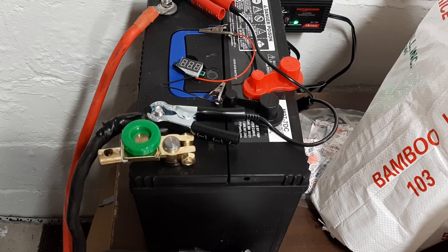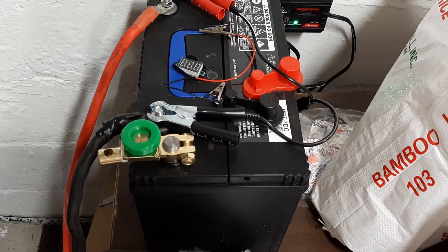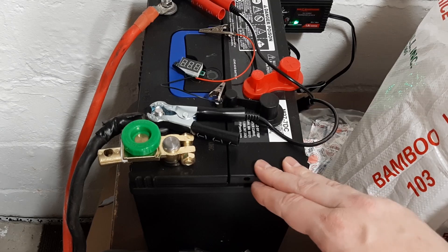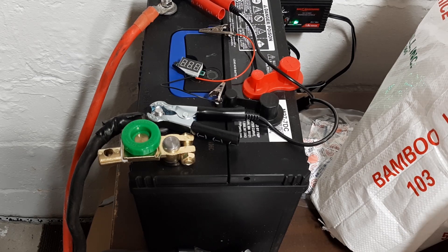If you have a source charging the battery that's running the inverter at more than 19.8 watts, you're good. But this inverter is not 100% efficient - not even close. My guess is probably 10 to 30% loss to noise, fans, step-up voltage, heat, just anything. Inverters are not notoriously efficient. And based on battery specs, it's probably only about 80 amp hours of usable power compared to what they advertise.